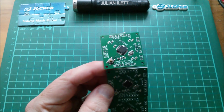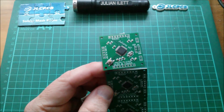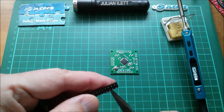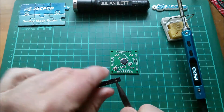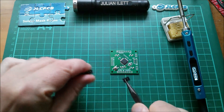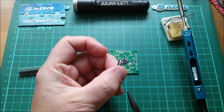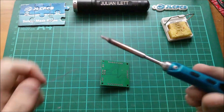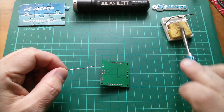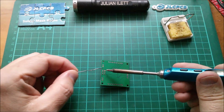But is there a way of checking that? Let's have a look. A 2x3 — I can't remember how you do this now. Yes, a 2x3 header for the ISP programmer. Let's clean the iron and solder this in.